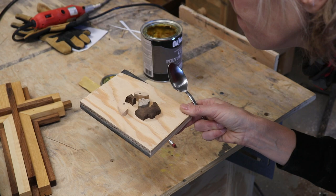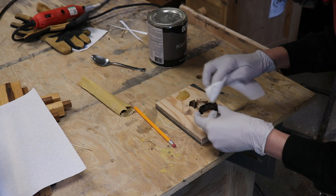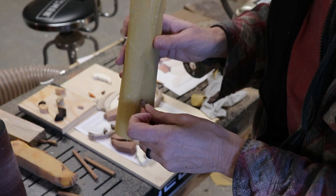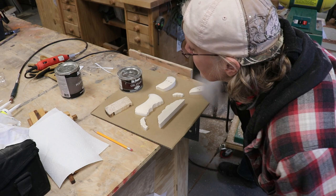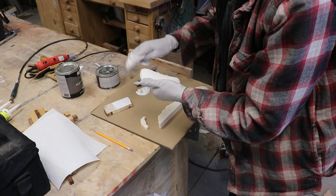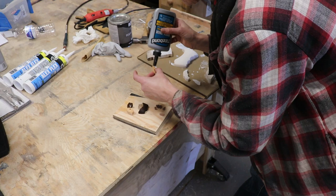I'm going to put the Old Masters on the owl pieces, but not on the sides, just because I'm going to end up edge gluing it together since it's so small. So I wiped the Old Masters gel poly on and wiped it off, and let it set up for about six hours. In the meantime I worked on those walnut plugs I made for the buttons and the eyes. I'm going to put pickling white on the snowman body and the snow and try it on a piece of wood the same as the hat, just to see what happens.